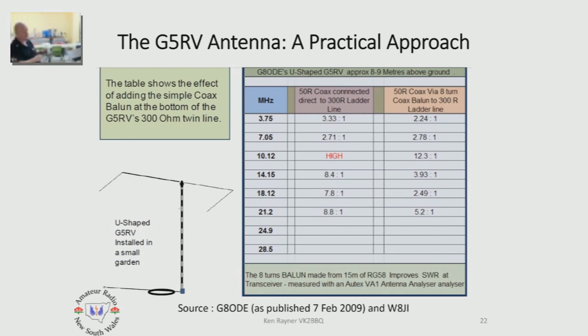You've got to look at it 3D. So that's 0 degrees. That's the way you've got the antenna in an inverted V. So if you bring it up to 45, 90 degrees, like that? Yes. Correct. So where have you placed your two ends? Is it 45 degrees to the horizontal? Basically, I put them at the same geographic plane. Oh, so you're looking at 0 degrees. 0 degrees dog leg. Yeah.